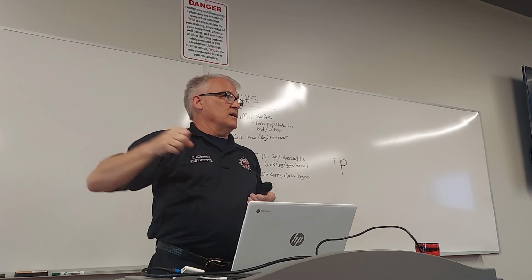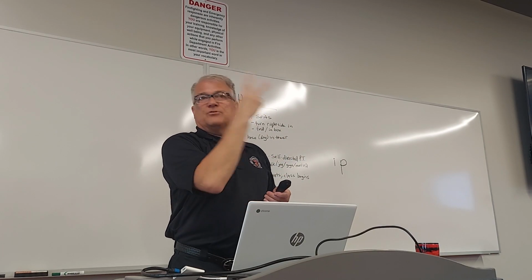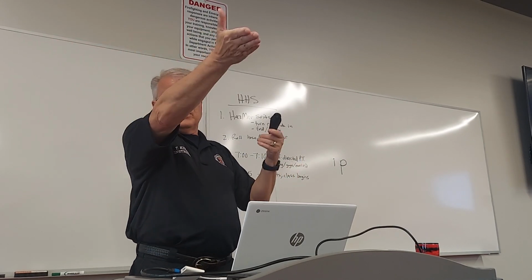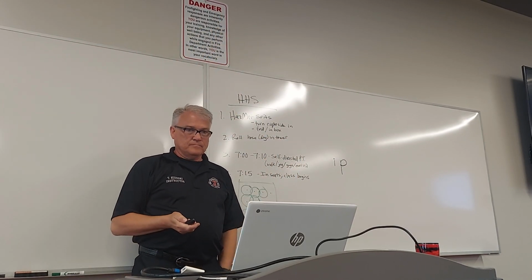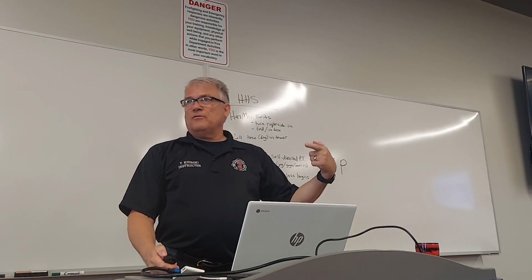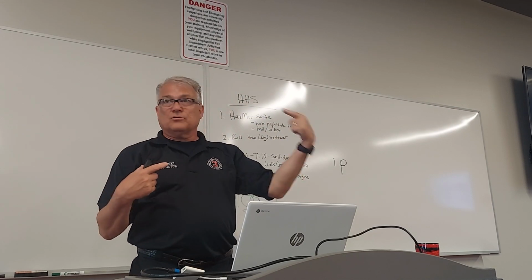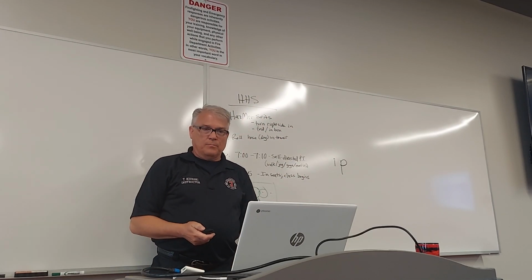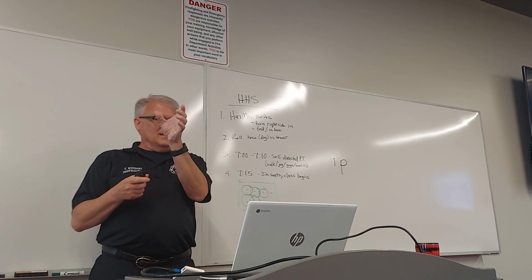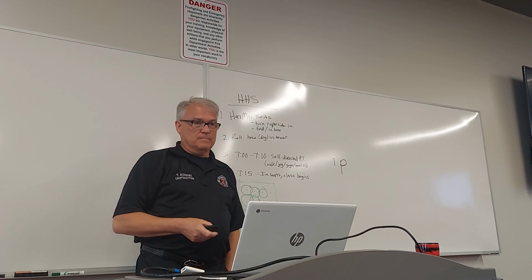What are you supplying? Volume and pressure. If it needs either of those or both, it will take them. If not, it sits there just like the water behind the faucet. Okay, so check valve, it's a one-way preventer, so water doesn't go both directions, so there's an arrow on that one. A ball drip valve keeps from freezing, so if it goes outside, it's got a drip valve to make sure it doesn't go outside the freezing temperatures.